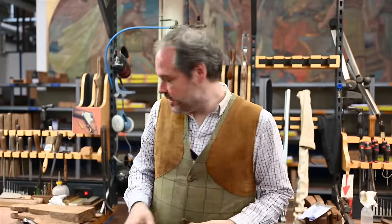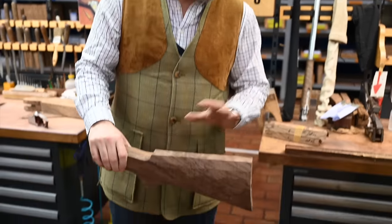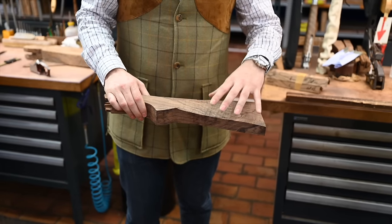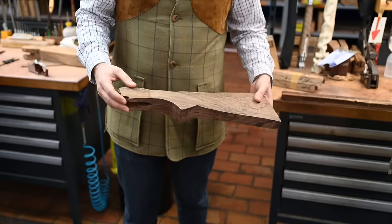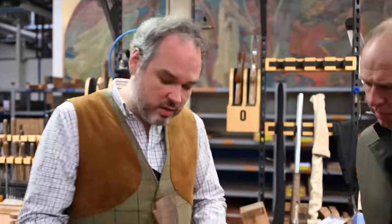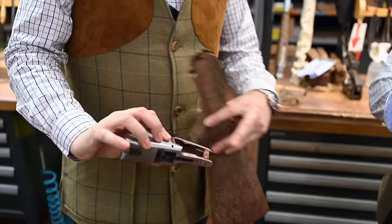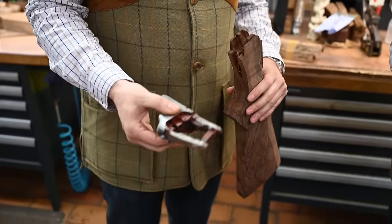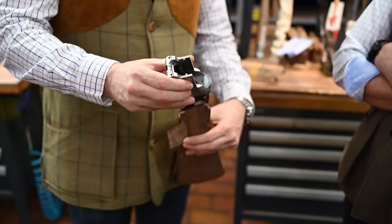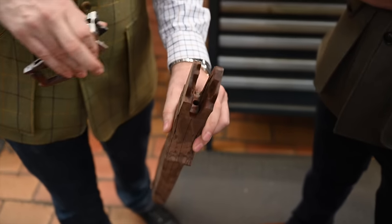When the measurements are done, we will make sure the drop, the cast, and the lengths are perfect, and that we keep the best zone from the block. Then, to make the fitting, it's a technique quite similar to black lamping. We add some red pigment on the metalwork, and then we start to enter the receiver into the wood, and you can see the contacts.